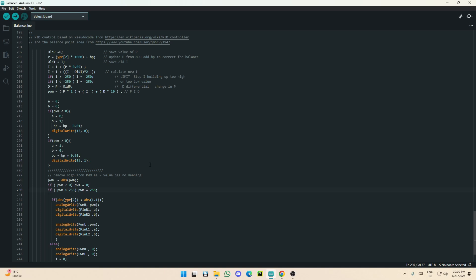This code uses PWM output: when it's too far off-balance it speeds motors to full, but under a certain threshold it keeps motor speeds low to stabilize rather than causing violent shaking. It sometimes still shakes, but that's due to a different reason.